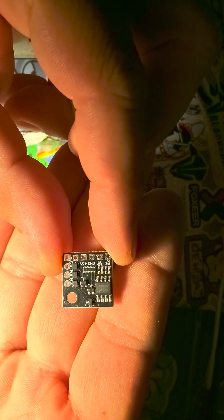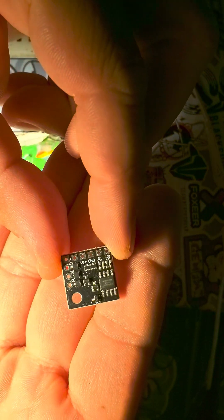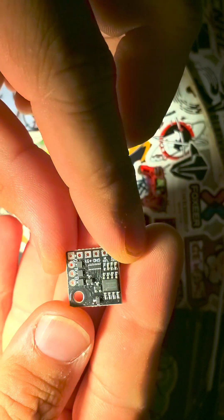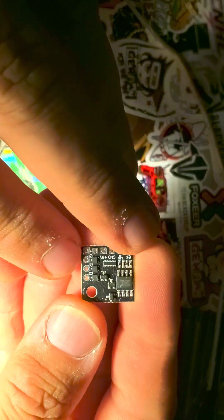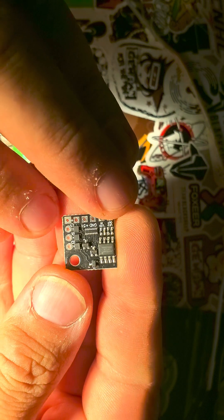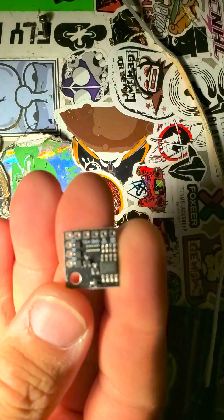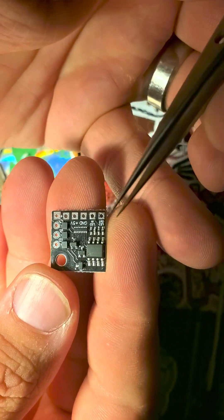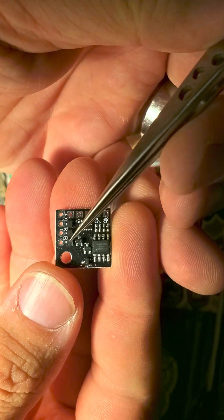The four-in-one chip is basically four of these in a single board, allowing you to have four separate color zones. Those same four wires that are on the strips are going to line up right here on this edge of the board. The black is going to go right there for positive, and then you've got red, blue, and green — green, red, and blue — right down here.